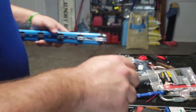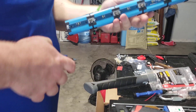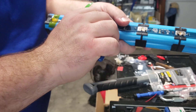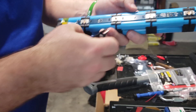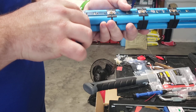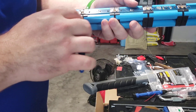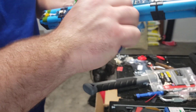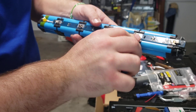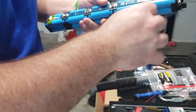I got some news — I got those slips from Amazon, these blue ones, like a five-pack. Out of the five I think I got two that were good enough for doing the 18650 tabs, because if they're not flush on the bottom it's hard to get underneath the tab. I tried grinding the bottom of them flat but I can't get it flat — it almost has to come from the factory that way. So I bought a pack of five hoping at least one would be good enough to get up underneath the nickel strips.